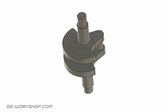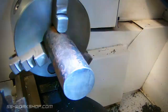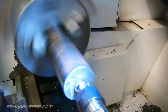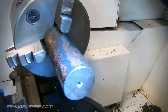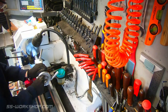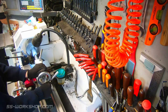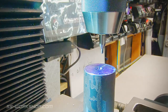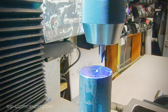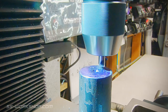There are a couple of ways I could have made these crank axles - out of separate pieces, or as I've chosen to do, out of a single piece. Starting with a section of 40mm mild steel round bar, this has center holes drilled in each end using the self-centering three jaw chuck on the lathe, which ensures the hole is concentric with the part. Once that's complete I scribe a parallel line on each end, then take it over to the mill to drill an offset center hole on each end.